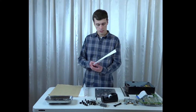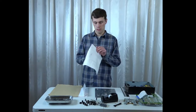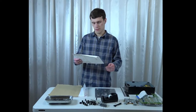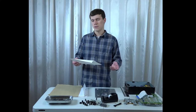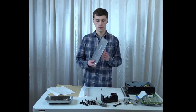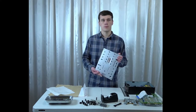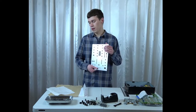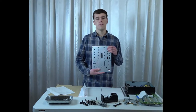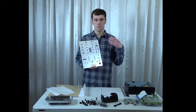Well, I am sad to say that the whole idea about making the toner transfer happen just simply didn't work. What I found out is that the toner, in order to have it melt, which I'm not sure we exactly needed to reach that temperature, but according to an online forum, it was 120 degrees Celsius. And the Rust-Oleum spray paint that I used could only stand about 46 degrees Celsius, I believe. So I ended up also melting the dried spray paint on here as well, which wasn't good. I re-spray painted, I sanded off where I did the toner transfer, and then re-spray painted it again. So, back from where we started.